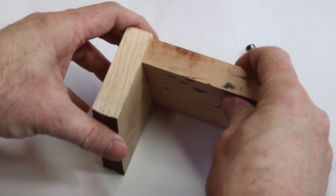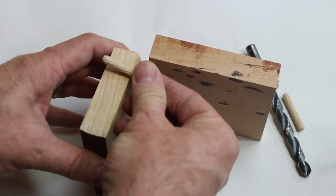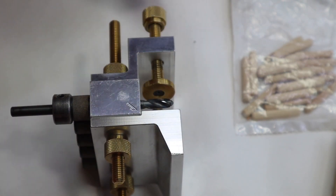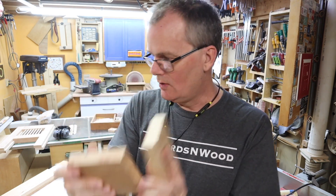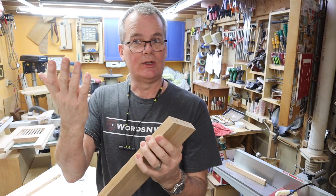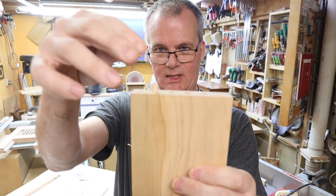In this situation, because we're joining boards at a right angle and you want your dowel to fit there, this thickness is a problem. This board is the same thickness as the piece that I'm drilling into, and as you can see the drill bit is just going to be too deep. You don't want it poking out the other side. So — kind of a long-winded explanation — just to say that when you're using dowels in a corner joint like this you really have to be cautious that you're not drilling too far. Normally in a typical joint you're going to drill equal distances both ways, but you can't do that here because it's going to go too far. I've already drilled the holes in my long rails for the table and I took the stop collar out, so these holes are almost an inch and a little bit deep, so there's tons of room there.